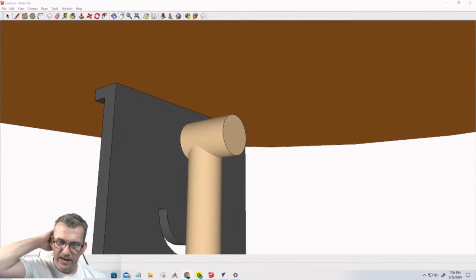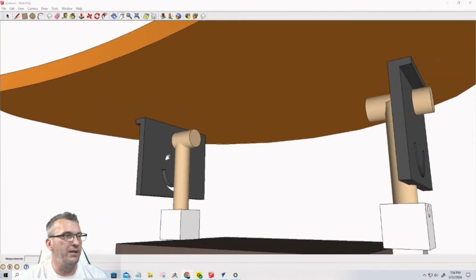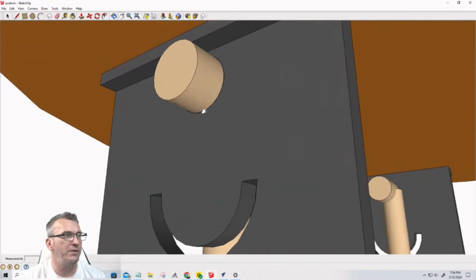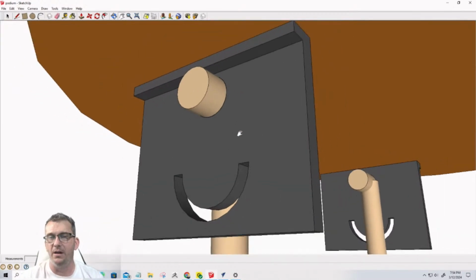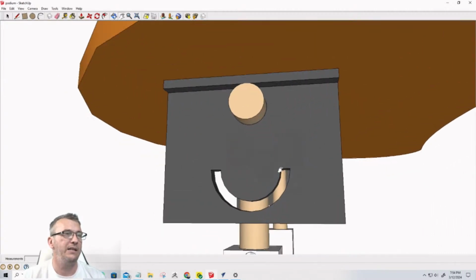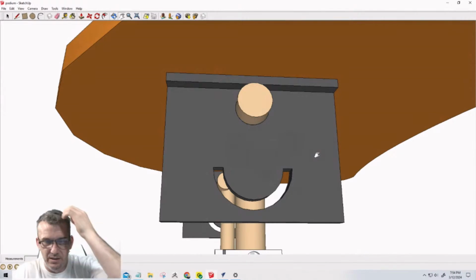Brooks, could you fab them on the CNC in aluminum or brass? You sure could. Absolutely. Now, most CNCs are wood routers, which can carve non-ferrous metals: aluminum, copper, brass, titanium, and bronze. It depends on the power and the rigidity of the machine, of course. You would have to take it slow and easy, but you absolutely could, 100%.